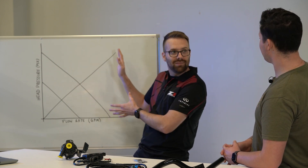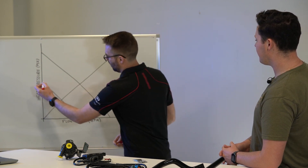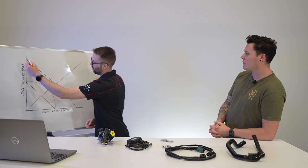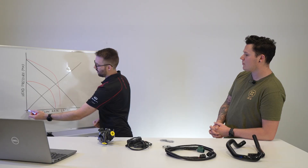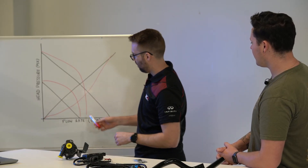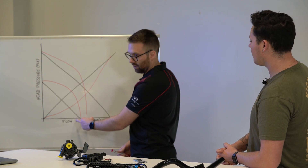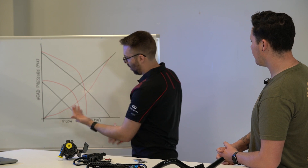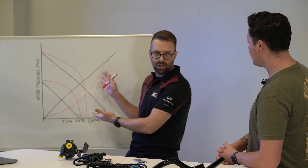But this isn't actually how it works. What these curves actually look like is: if you have a single pump, it does something like this, and if you have a double pump, it does something more like that. And your fluid resistance curve is going to look more like an exponential curve. What you find is that these crossover points are now much closer together, and this is why when you add a second pump to a system, your flow rate doesn't double — because these are not straight lines. So you're going from, say, six gallons per minute to seven gallons per minute, based on this particular example.